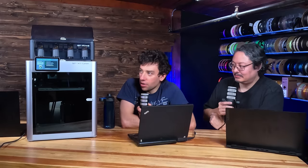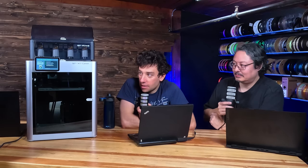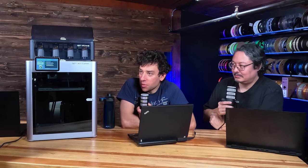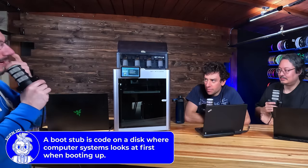We are now installing base firmware. They did recently remove the ability to downgrade. You're installing 1.7.1 on here right now. The thing about X1 Plus is that we install almost nothing inside the printer — just a little tiny bootstub. Remember the 512-byte PC bootloader? We install about a two-megabyte bootstub. X1 Plus gets installed entirely to your SD card.